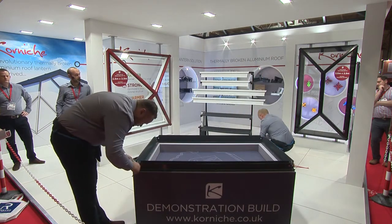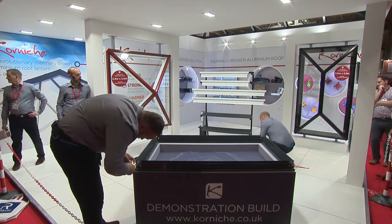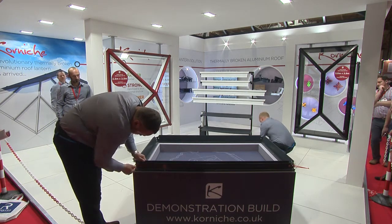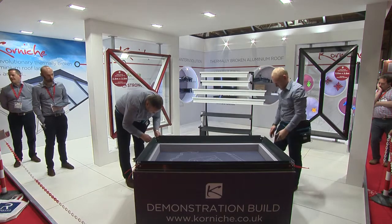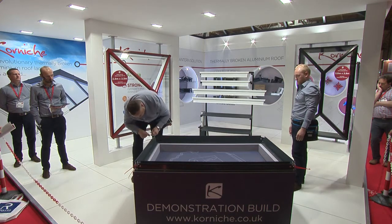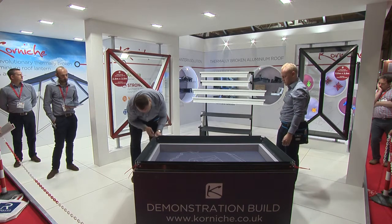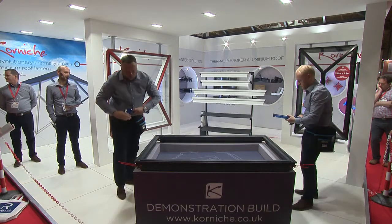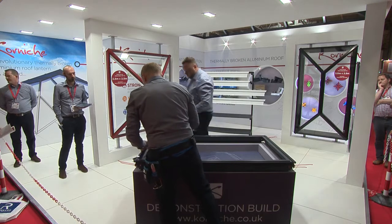So the next job that Bradley's going to do now is going to fit some of the fir tree clips into the finishing caps, just to save a bit of time later on. So once the zip ties are tight, they're going to flip that over. They're going to get their imaginary sealant guns and run a bead around the gutter where the bolt holes are. When you do this in reality, you pay a lot of attention to getting it right into the corners to make sure you've got a good seal.